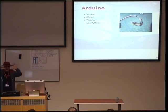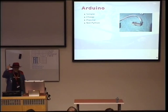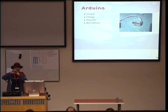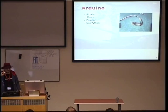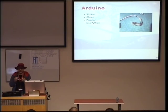I learned that the big Arduino board that you can buy for $40 is not actually the best choice for hobby projects like this, because there is this board called Pro Mini that has exactly the same electronics as the Arduino board. It's much smaller, you can put it into your project, and it costs $2 from China, of course. So much better approach, and they are very easy to program, because you just start the IDE and connect them. In the case of Pro Mini, it doesn't have USB because that would make it more expensive. Instead, you have to use a programmer like this. You connect it and program it through this. But then you leave it in your project. You can reuse the programmer for other projects, right?